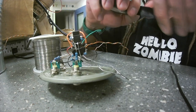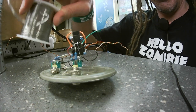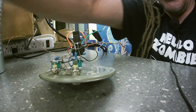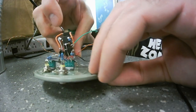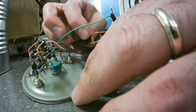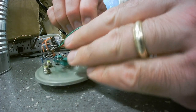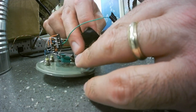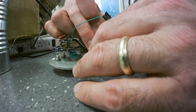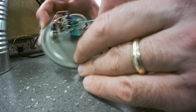When you're powering up your circuit for the first time, you want to make sure that any conductive bits like solder, discarded leads, cut off bits of scrap wire, pieces of tin can, or if you're using something besides tin cans, bits of scrap metal are not sitting on your bench waiting to make a surprise connection between different parts. Ooh, I forgot one very important thing.